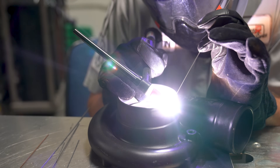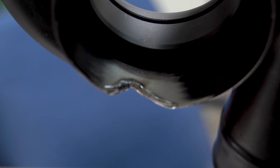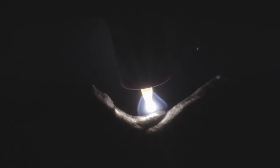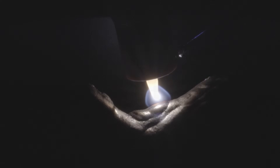As a side note, I decided to shoot these arc shots with my less expensive camera just to see if it was going to work. Sadly, everything on this repair can only be done in one take, so my apologies — these last couple arc shots aren't as clear as they typically are. But either way, this is about what it looks like after the first build-up pass. The goal in this build-up is to get everything done in one single session — I don't want to build it up, grind it, and then go back over it again. I need to throw down a heavier bead and push a little bit more metal into it so it bulges out much thicker than this piece actually is. This ensures that I'll be able to grind and smooth it all back down nicely without having to build it up again. If you don't put enough metal back on, it's just not going to look right.